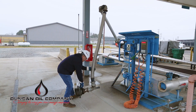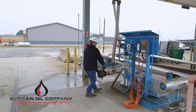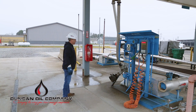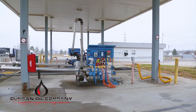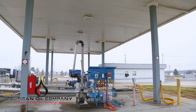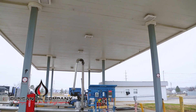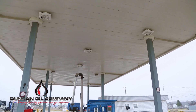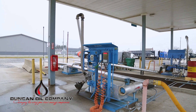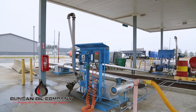Examine the loading bay to ensure it is clear of obstructions and that no loading arms, hoses, or cables could be damaged upon entering. Do not enter the bay if there are any visible leaks or spilled products. Never drive into vapors or across a spill. Report any leaks or spills to terminal personnel immediately. Never enter a loading rack that has been barricaded or coned off.